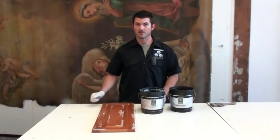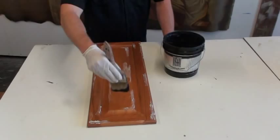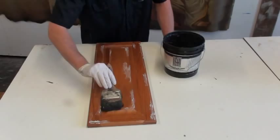Okay, so now that I have my plaster mix, I'm gonna take an oversized chip brush. Just load some on the brush, and I'm not gonna paint this as if I was just painting a cabinet door. This is a thicker plaster, so I'm gonna start on the inside area of the cabinet. And what I'm gonna do is just kind of load one side of my brush favored and kind of lay that flat. So I'm naturally not getting full coverage, because we're actually gonna do two passes of this